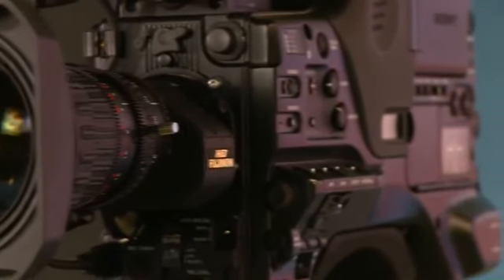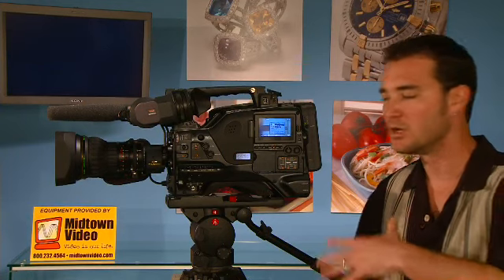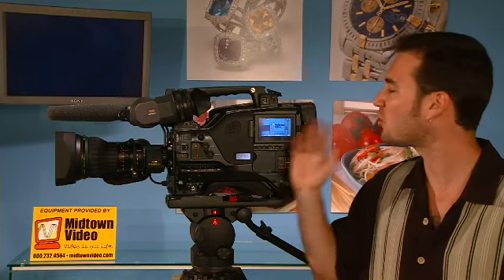Finally, let's talk about the slow shutter and white balance features. Slow shutter allows you to accumulate multiple frames of light on a single frame of recorded video, enabling virtual shooting in the dark — you don't have to boost the gain at all. It also gives you very creative leverage over light: you can make things blur, do cool time lapses, and most importantly, if you've got static video, you can make pitch black darkness show up bright as day on the viewfinder. I encourage you to experiment with slow shutter.